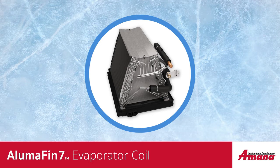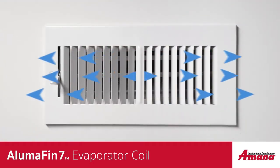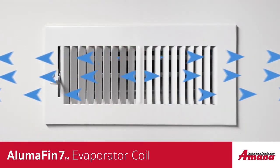When the warm, humid air from inside your home passes over the cold evaporator coil, the water vapor in that air condenses on the evaporator coil. That's a technical way to say the cold evaporator coil removes humidity from the air inside your home. That conditioned air is then returned to your home through the ductwork.